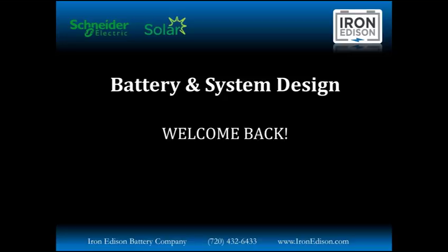We are seeing no challenges or problems with using the Schneider Electric charge controllers and our lithium iron phosphate batteries. Even with a nominal 52 volt lithium iron phosphate battery, as I said, the maximum charge voltage is well within the parameters. We're shooting for about 56 to 57 volts DC on a lithium iron battery, well below the 64 volt maximum output for a 48 volt charge controller.